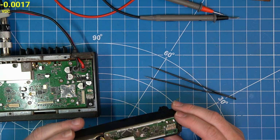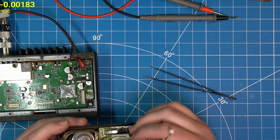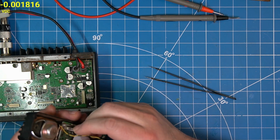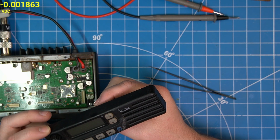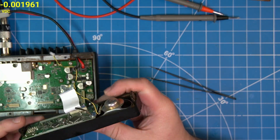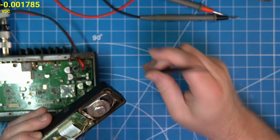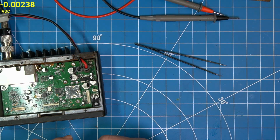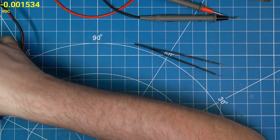Now, ribbon cable looks good. These things tend to go bad. This thing is real disgusting, filthy. I'm just wondering if it's possible any liquid damage or anything spilt into it. But other than it being really dirty, dusty, doesn't look like anything's going on. Let's try just plugging this cable back in, flexing it around, see if that makes any difference.